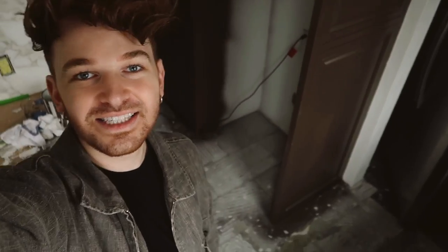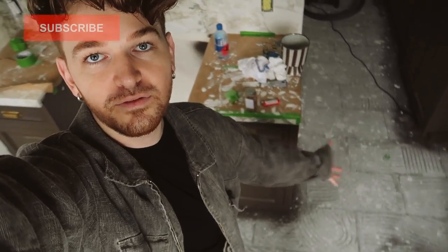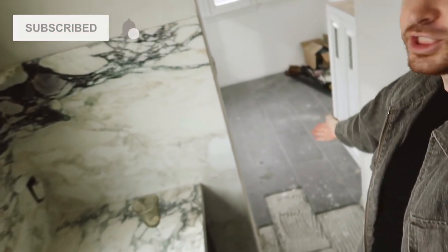As you can see the floor is currently covered in the old mortar. I removed the tile, which used to look like 12-by-24 slate-looking tiles, and we're left with this mortar. This kitchen was renovated about a year and a half ago — a newly renovated kitchen when I moved in, but just not my style. The subfloor which the mortar sits on is actually underneath the cabinetry. They laid all the tile first throughout the entire kitchen and then put the cabinets on top, which makes it challenging to remove those edge tiles. It also means the subfloor is traveling underneath the cabinetry and can't be removed easily.